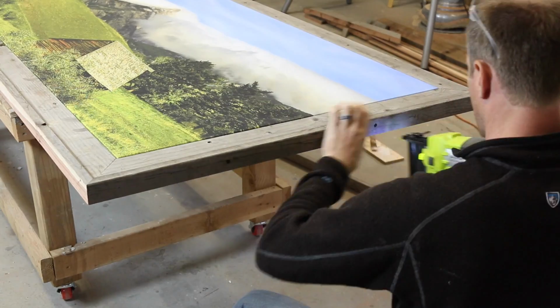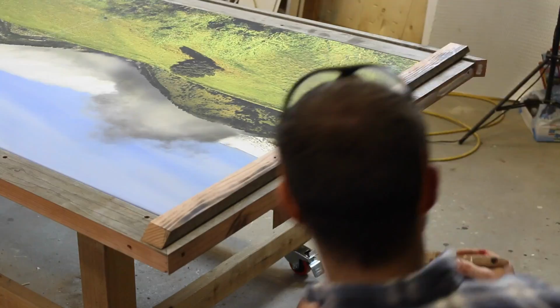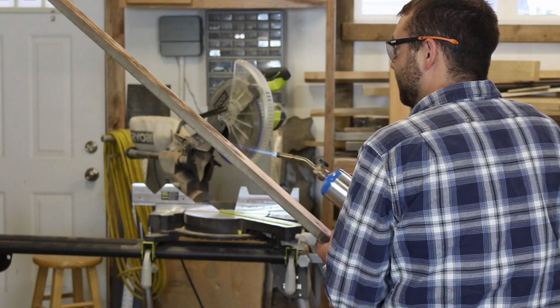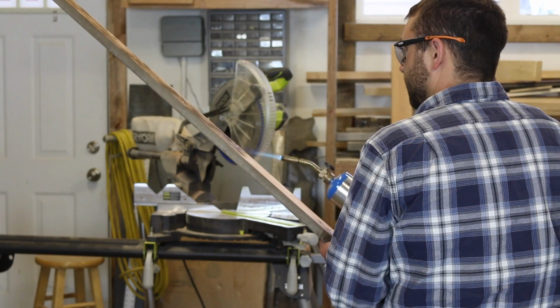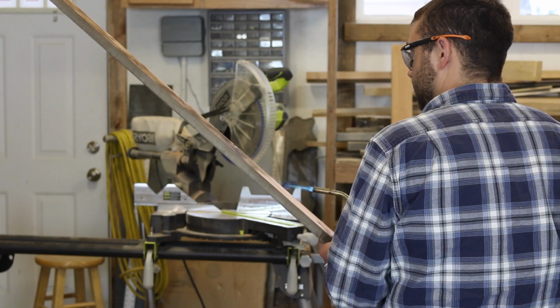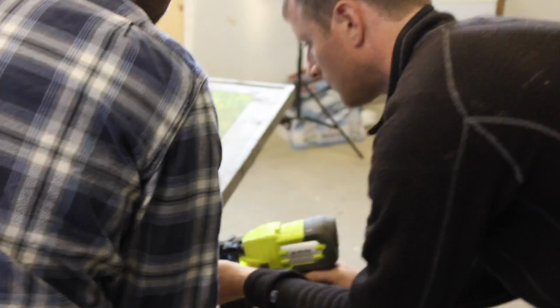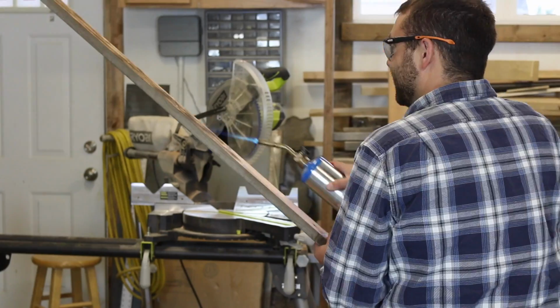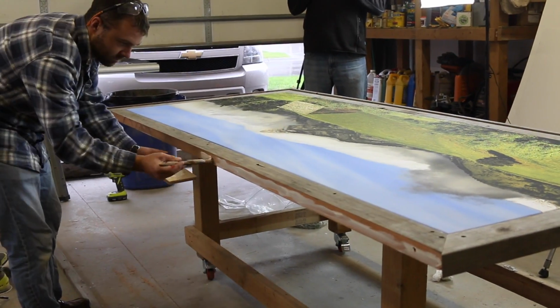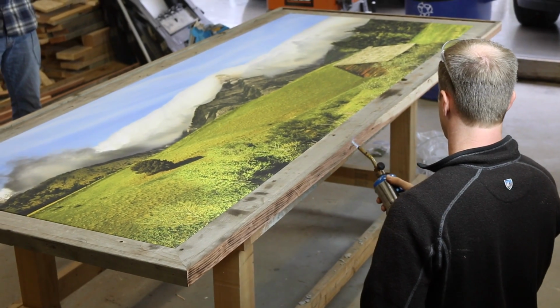If you are using reclaimed wood or barnwood and have any exposed edges, you can blend them in by distressing or giving them a weathered look using your method of choice. I simply used a torch to darken the exposed area and then attached it. Only about 3/8 of an inch on the 2 end pieces needed to be blended. Then glue and continue adding trim around the frame.